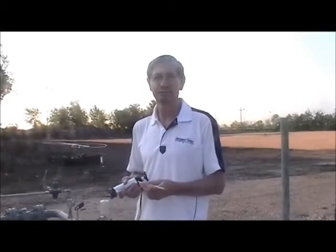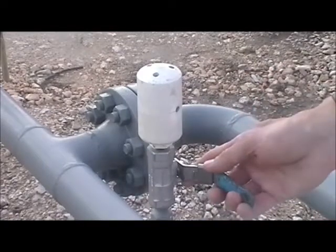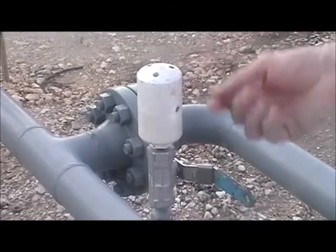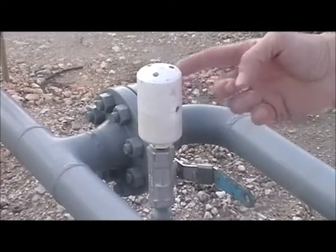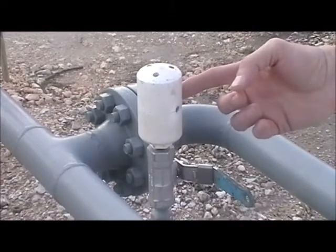Measuring water vapor in a gas pipeline, which is very dry, has special requirements to avoid intrusion of ambient humidity from the ambient air. To sample out of a gas pipeline, you'll need a valve connected to some type of sampling device. The sampling device could be just an open tube, but we recommend using a bulb of this type, which could be made of either hard plastic like PVC or preferably of stainless steel.